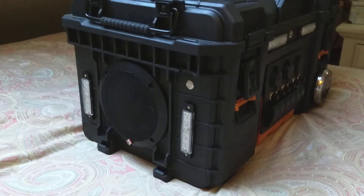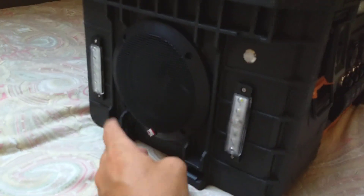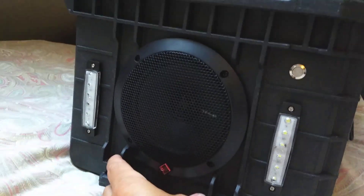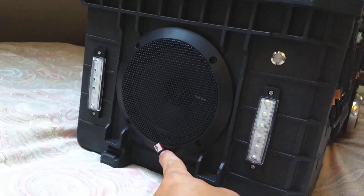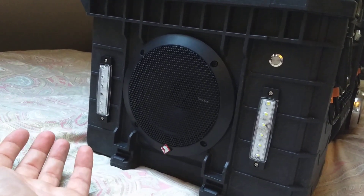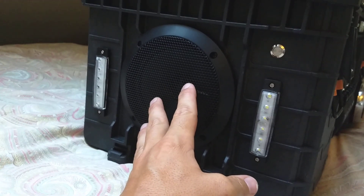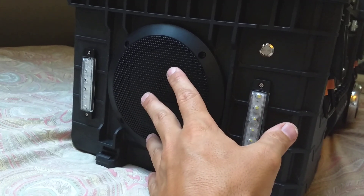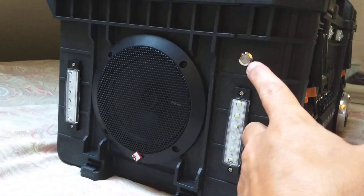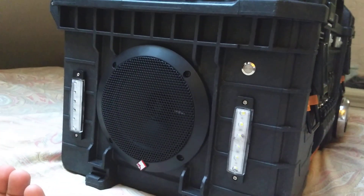When choosing the toolbox to make your power box out of, you've got to pick what accessories you want and then figure out the real estate — where everything is going to fit. On this end I've got some lights, a push button to turn them on and off, and my speakers for the radio. A 4x6 speaker would fit perfectly inside, but they're hard to find with a grill. So I went with a 5¼-inch speaker — a 4¾-inch hole saw makes the perfect hole with just a little grinding. Over here I've got some LED lights, very low output, with a simple weatherproof on-off push button.